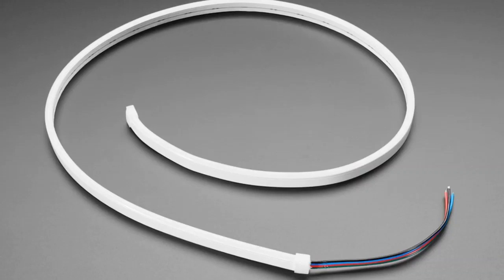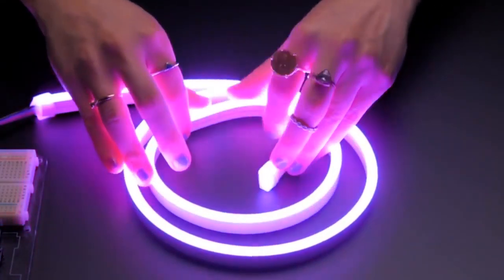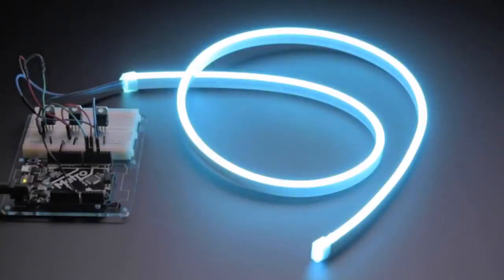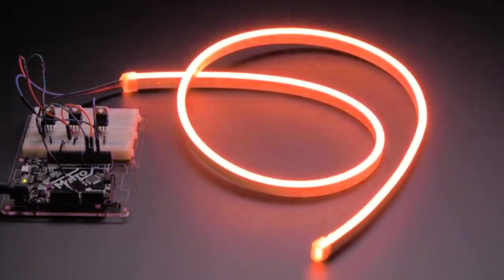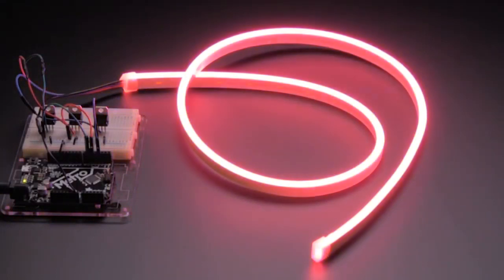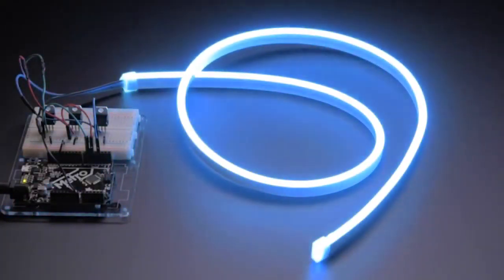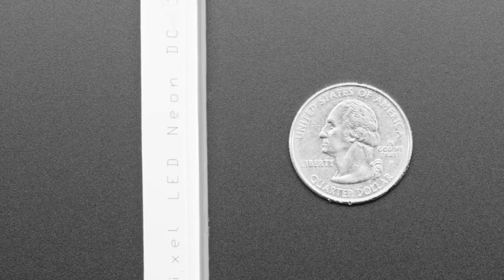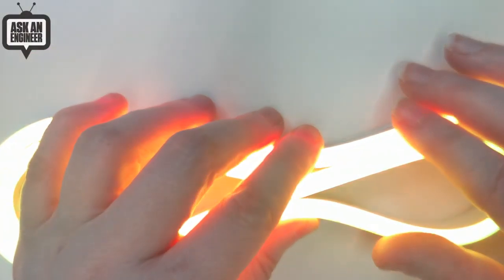We've got this — it looks just like a tube, but look how cool that is! This is super cool. We've had the neon LED strips for a while in red, orange, pink, green, and blue, and we had a chunky NeoPixel strip. But now we finally have a 12-volt RGB LED strip. It's not NeoPixel, so it's not individually addressable — you have to PWM the red, green, and blue components. But you do get RGB LEDs in it. They finally managed to figure out how to get these to be good enough quality. You give it 12 volts and PWM red, green, and blue to ground to change the color — just like any analog LED strip. It's extremely flexible and also bright, so it's going to mess with the camera.